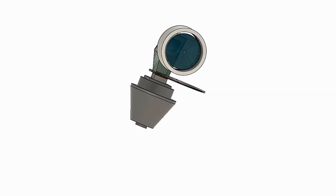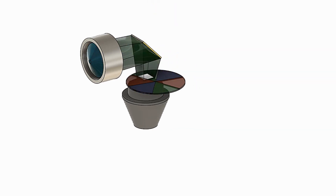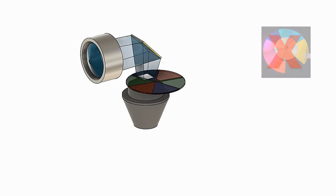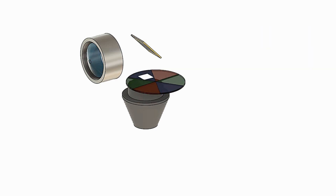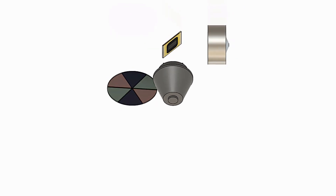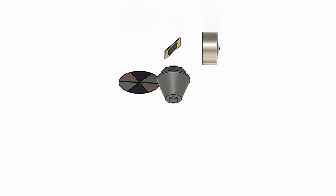Typically, three or four segment color wheels are used. Some color wheels contain yellow, cyan, or magenta segments in addition to the RGB segments — they are not suitable for our purpose. Let's consider a color wheel with RGB configuration only. The simple idea is to use the RGB color subframes as individual monochrome frames if the color wheel is removed from the projector's optical path. We get a bunch of extra black and white frames — these used to be the RGB planes. Basically, we sacrifice color and gain frame rate. This is the basic idea and defines which projector to look for.